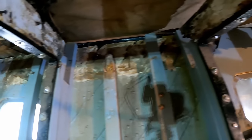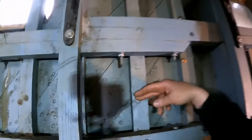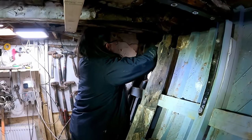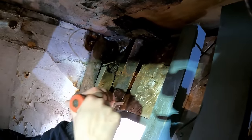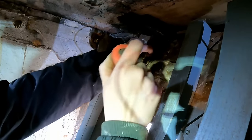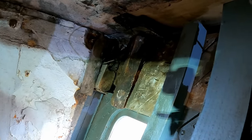Right, so the beam shelf's away now. So we've noticed that this frame here that was behind the beam shelf is pulled at the top. So we need to bring this down, scarf it down there somewhere. How are you looking, Jem? Getting rid of the top of this frame. Oh, the window one? Yeah. They're easy to change, those ones, aren't they? Yeah. Cut that copper nail.